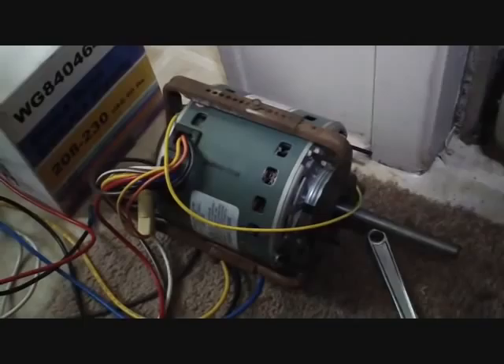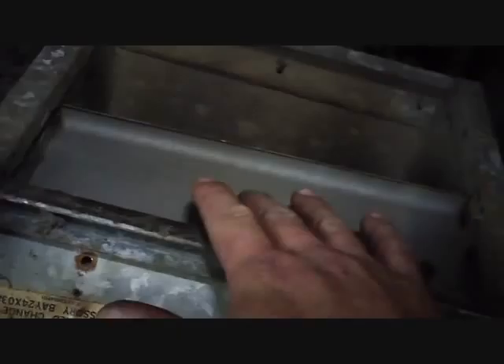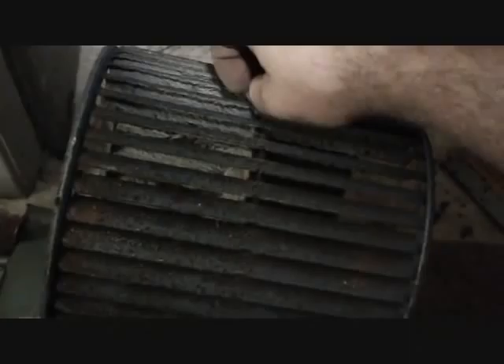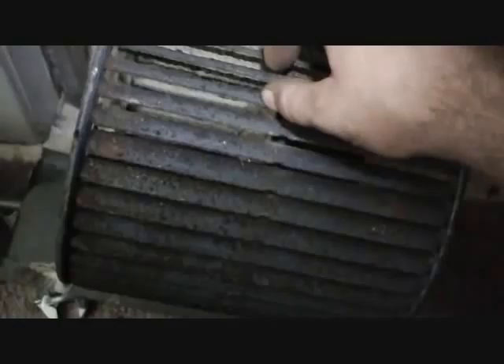There's my replacement motor — my multi-horsepower motor. Hopefully it'll jam in there quite nicely, we'll see in a second. Another thing I want to do — you can see down in there on the scroll cage there's a lot of dust. Every time you get a buildup of dust on fan blades it decreases the amount of CFM they can push, because their shape is by design, and if it alters that shape they go out of balance and it decreases efficiency. So since we're opening it up, let's go ahead and clean it out — it hasn't been cleaned out probably in 20 years or so, it's due. This plate in front of the blower screws off on the sides. We take that out so we can remove the scroll cage, which is easier to do with two hands. We'll take that outside and brush it off — get it back in as close and balanced as it can be with the pieces that have rusted away over the years.